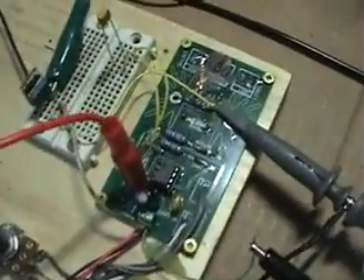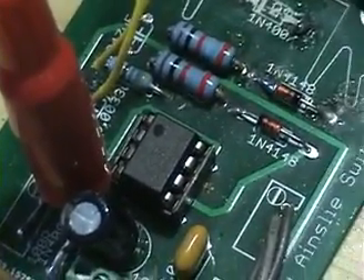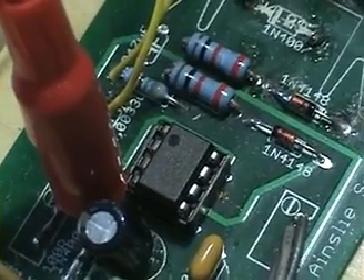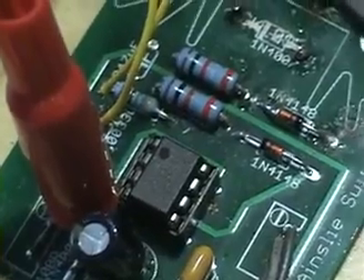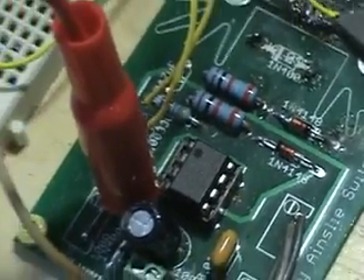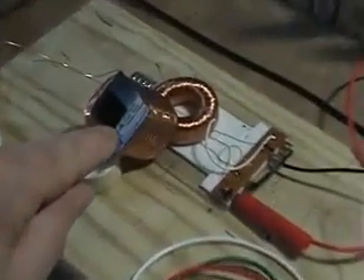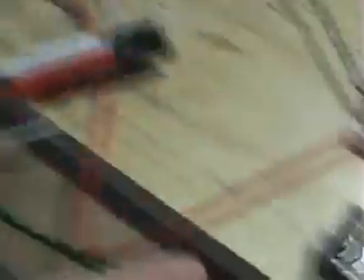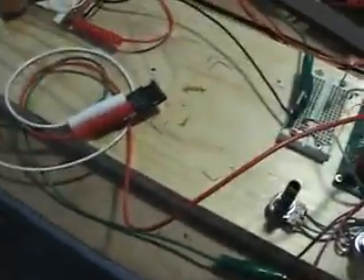What I have changed is in the 555 timer circuit — I obtained a CMOS 555 chip to replace the previous one. This CMOS chip utilizes only microamps. The idea is powering that from the secondary coil pickup here and powering the 555 circuit to do the switching, so we have an isolation happening in the circuit.